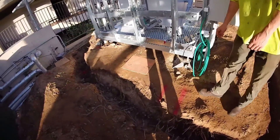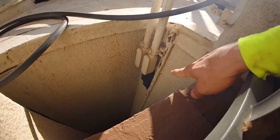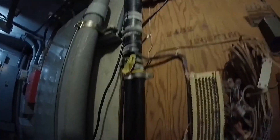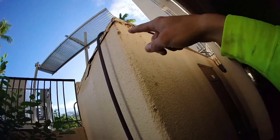I need to ask about the fence pole specs, but basically we're going to hit this wall, LB onto this wall, stay above this door, and come into here. We have two holes that have been cored into the wall to get into the electrical room. We'll probably take our top one, and then the conduit is just going to run to right here on the wall and end. This is their fiber area — that looks like a giant fiber cable if I were to guess, but I'm not sure. We'll move out of that hole, offset up — and now that I'm thinking about it, because it's a fiber run, we might actually need to use a 1212 junction box on this wall. If we do an LB or a JB, then we just go that way.